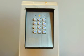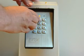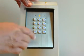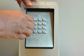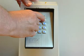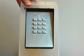Continue this up to 99, changing the location code each time. To set users on relay 2, you would press 2, then location 0, since there are only 10. Then you would press any 4 to 8 digit code — in this case 1234333. Press pound. Confirms acceptance.